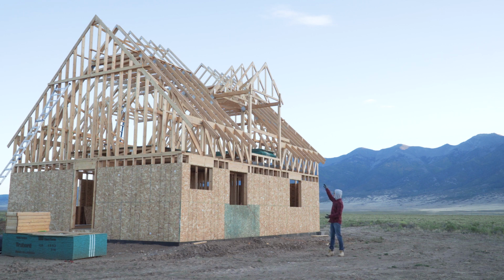There's going to be a bit of work to do here, building out the middle around these dormers, and then some bracing across the stairs so it's ready for the sheathing. So I'll make another video when I'm building that out. But as far as hanging the trusses, that is done, and bracing them and all the rest of it that had to happen. So these diagonal braces and blocks here, that's a code requirement. And then all the other bracing that's up there, which is 2x4, that is per the plans. So good to have that all done because it was a bit time consuming.